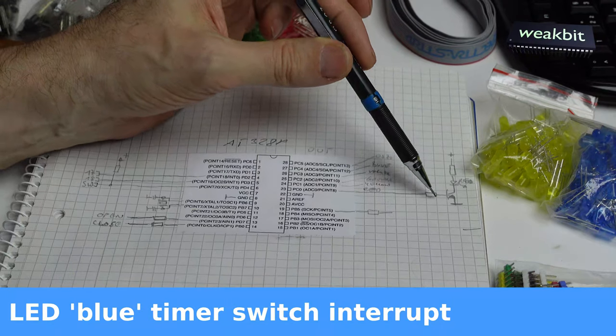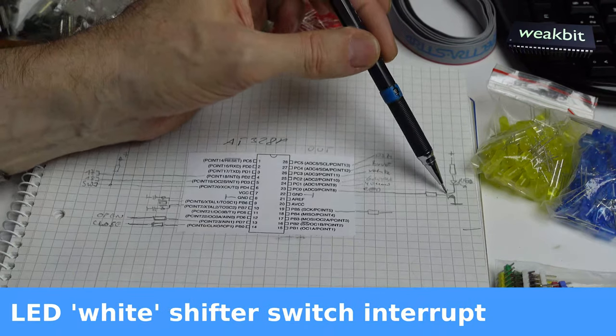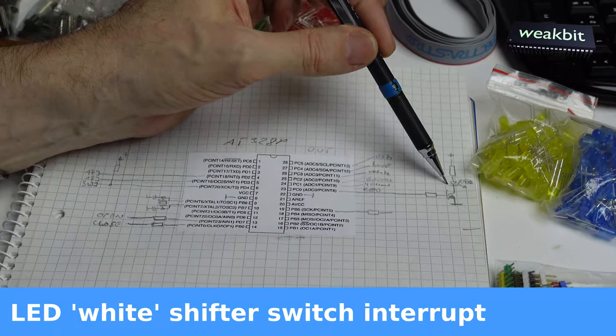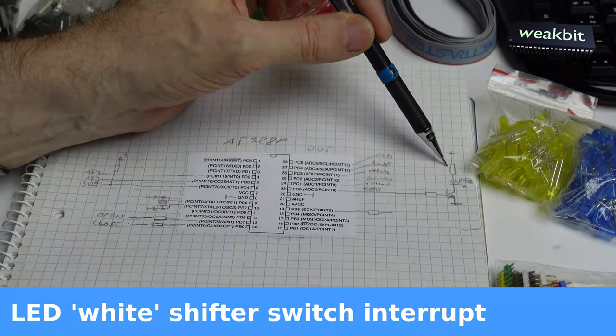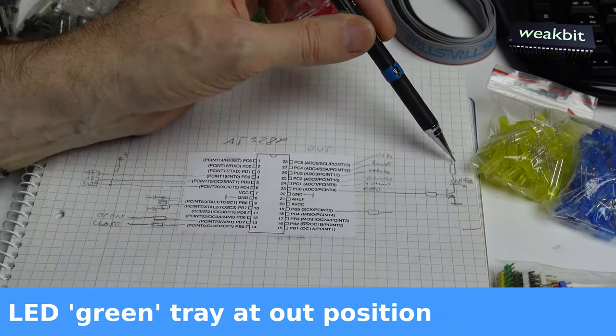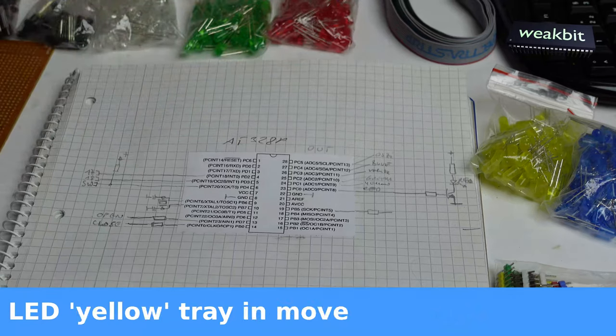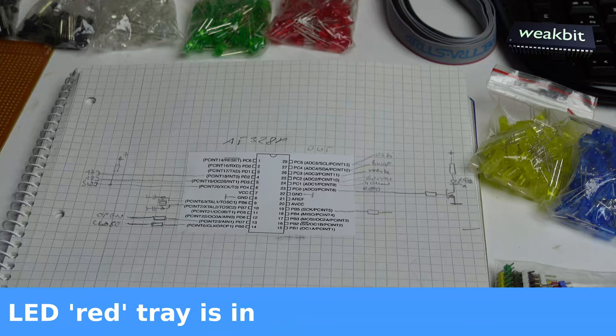thing here, a base resistor. Here we have an NPN transistor and the light diode, the LED, with a current limiting resistor. We don't run that at 20 milliamperes like the Chinese with the blue LED. They kick you in the eye. We do that with a normal current, 2 or 3 milliamperes, and this is more than enough. We're doing the calculation at a later time.